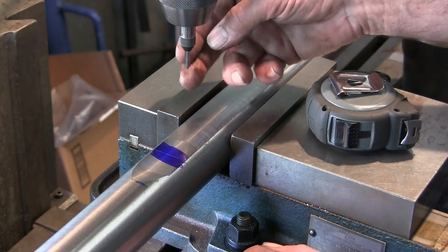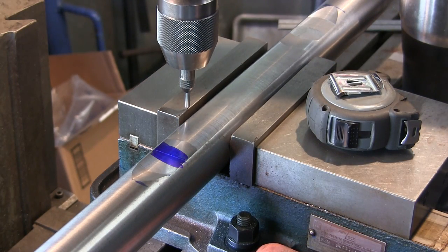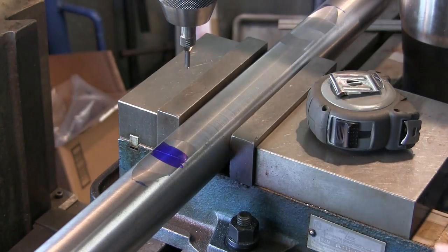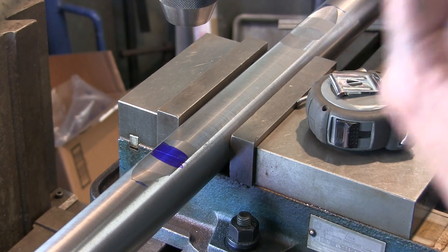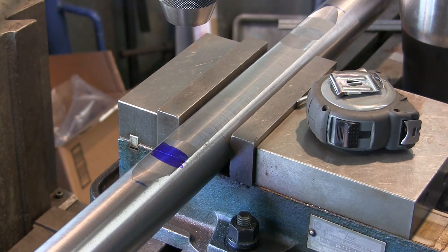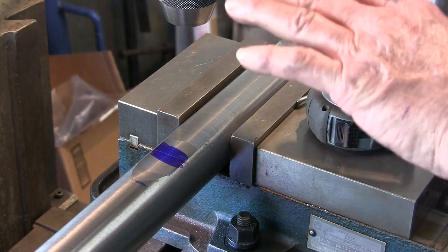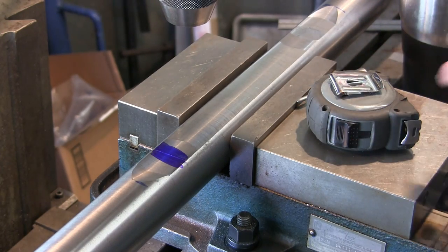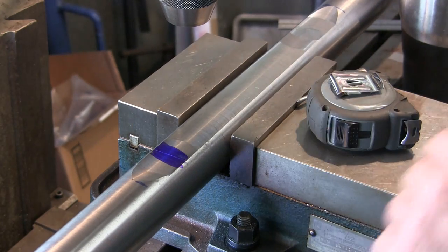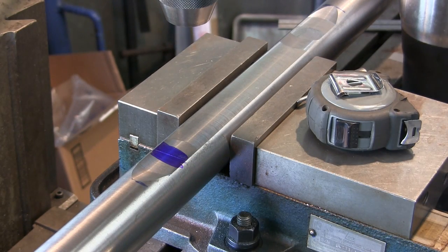All right. I just double checked. I take my tap follower sometimes and lightly screw it in here, and I came down and verified that my readout was zero with the edge. I hadn't changed it. I just wanted to confirm that I did set it to the vise, and it looks like it's there since the last time I checked the vise. If this was a super critical part, I would recheck it physically with the edge finder and so on. But for right now, I'm just going to take it there. I'm close enough. That's an eyeball zero.